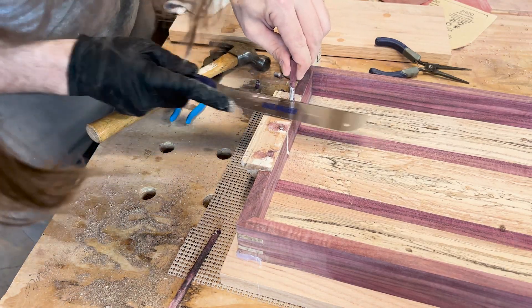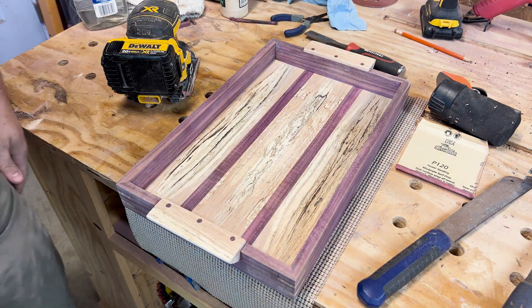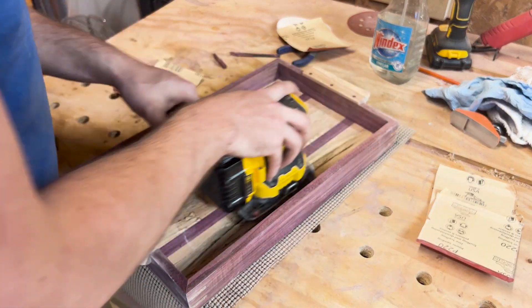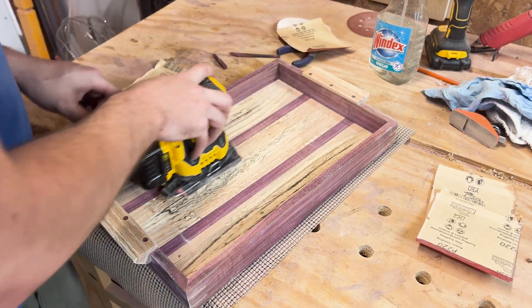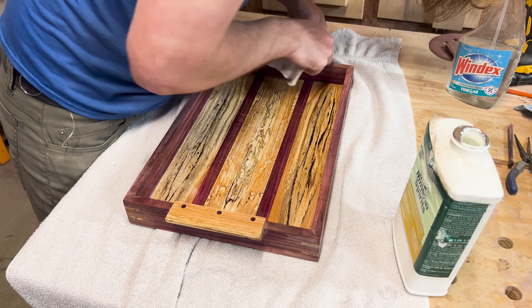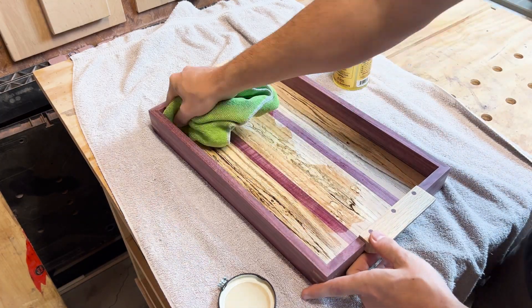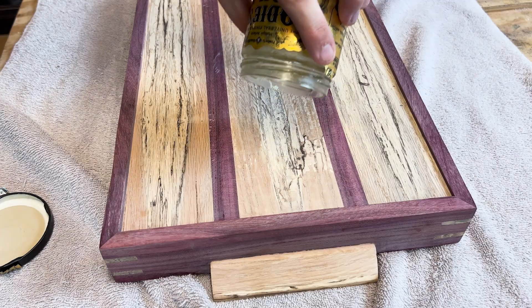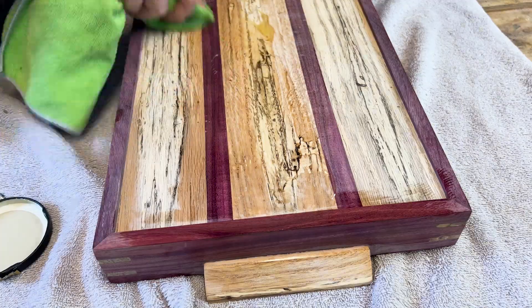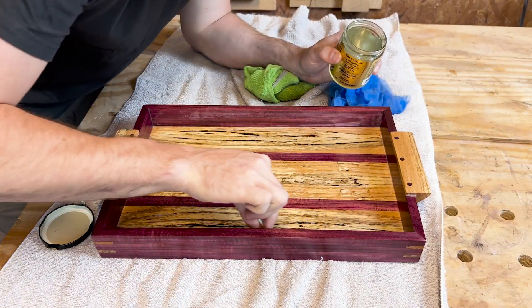I then start the finishing process, sanding the whole piece over again. I work my way up from 180 all the way to 320 using a sheet sander so I don't create any divots, since the pieces are so small. I pop the grain in between grits so there are no ridges between pieces and it's smooth to the touch. I then use mineral spirits to remove any sawdust trapped in the grain and show any areas I might have missed while sanding. I then apply two coats of Odie's Oil, which is a wax finish that is food-grade safe when fully cured. You can really start to see all the color when Odie's is applied — especially the darker purple from the purple heart, and the black spalting in the maple gives it a really stark appearance. Odie's also has a really nice citrus aroma. I make sure to go over everything really well and even grab a cotton swab to get to those hard-to-reach places with the finish.